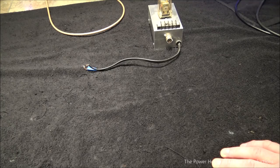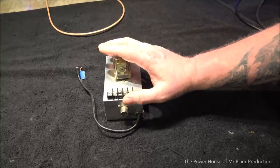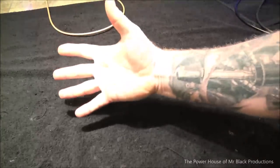So, you have these incredibly sensitive radios these days. Not built with tubes and not rugged tanks like the old Collins. They're very delicate. I know this because I had an Icom 756 Pro 2 that within a month of me having it, I couldn't hear an air raid siren as a transmitter going off next to that radio. It was deaf as a post. Blew all the diodes right out of the front end of that thing, completely desensitized it. And that was with a 5-watt radio.